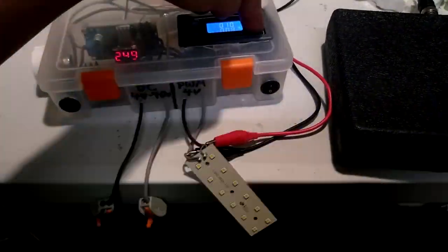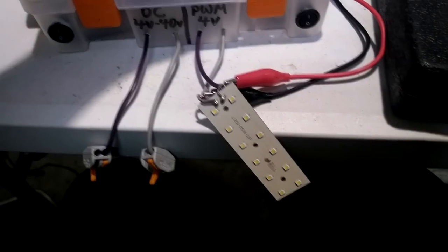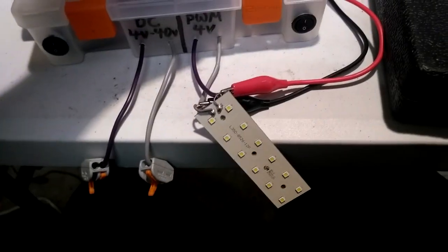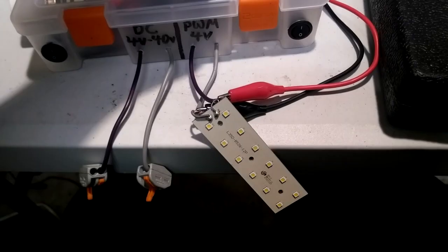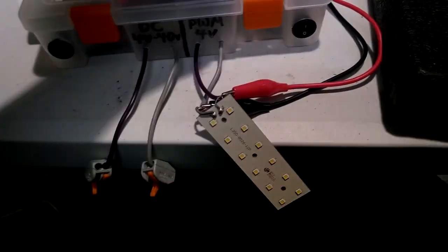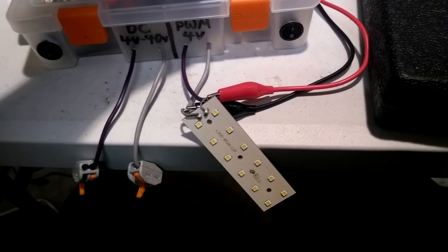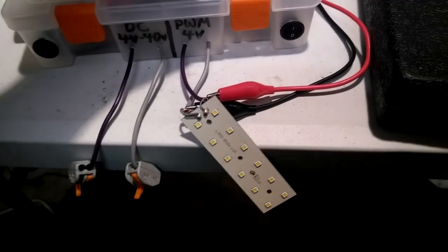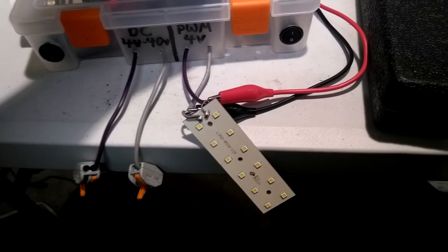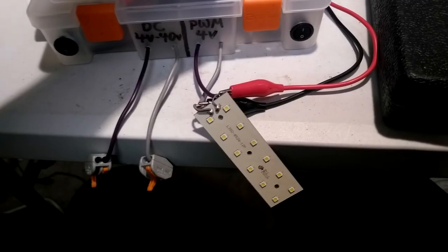You've got an average voltage, an RMS voltage. Now let's put it back to 1 hertz. So you've got 25 volts or so across this load every second. Is it seeing 25 volts? What's that seeing? Well, the RMS, or the average, is not going to be anywhere near that 25 volts because of that fleeting pulse right there, that 1% duty cycle. But it's still receiving a 25 volt pulse throughout some period in time.